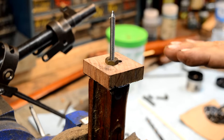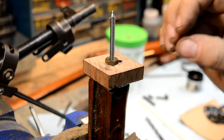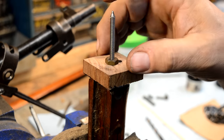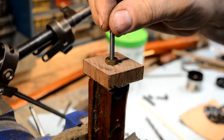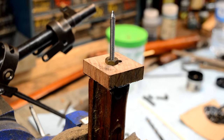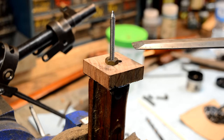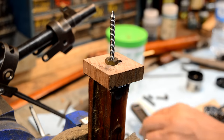Now the way I just did this, it made it a pain in the neck to get this thickness right, but it makes the repair better. If you did this repair without the stud in it for alignment initially, it would be easier to surface this off, but you would never get this bonding strength that we're creating here. So I'm opting for a little bit more work and the endangerment of the edges on my chisels, because as we clean this up, we'll have to be coming right up against that, right? I mean, I'm opting for that. That's a choice. All right, I'm gonna push this epoxy and we'll get right back here.